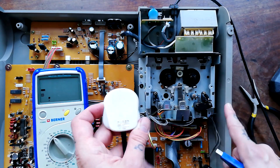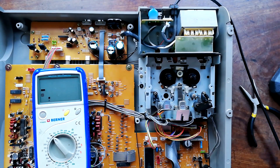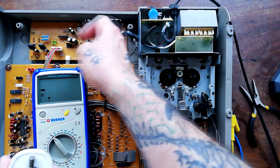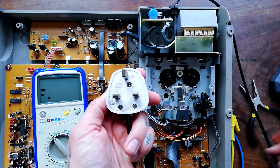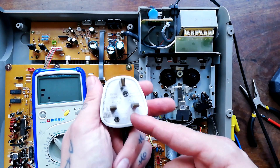This particular unit, when I got it, didn't power on. I opened it up, tested these fuses and they were fine. At that point I might have easily gone and started fiddling around with this, dismantling everything to check for broken solder tracks. Fortunately I had the presence of mind to open up the plug — and although I've since replaced it, there was no fuse in the plug at all.